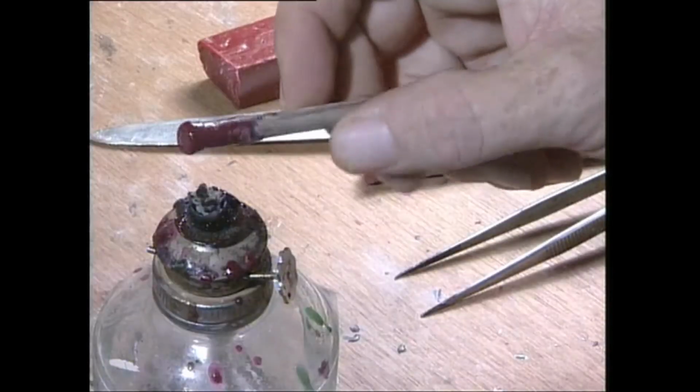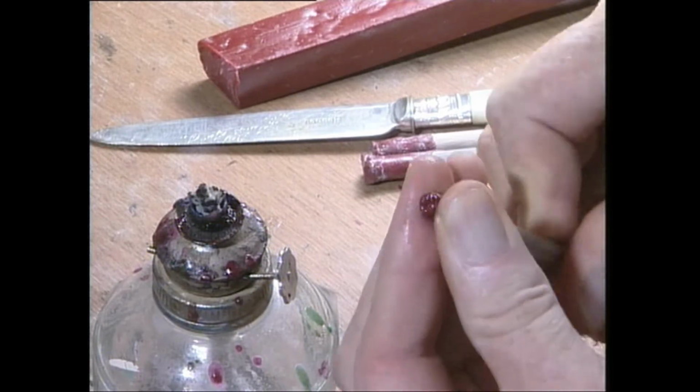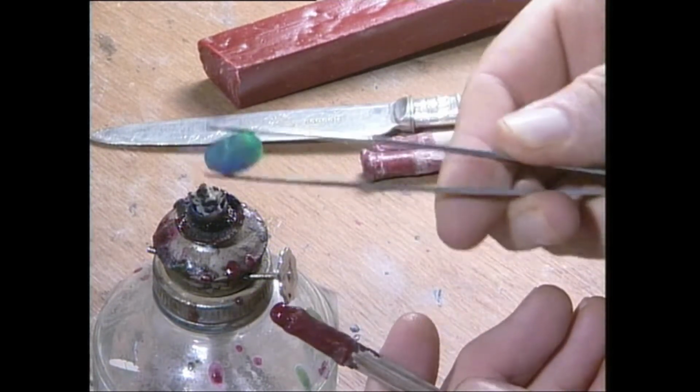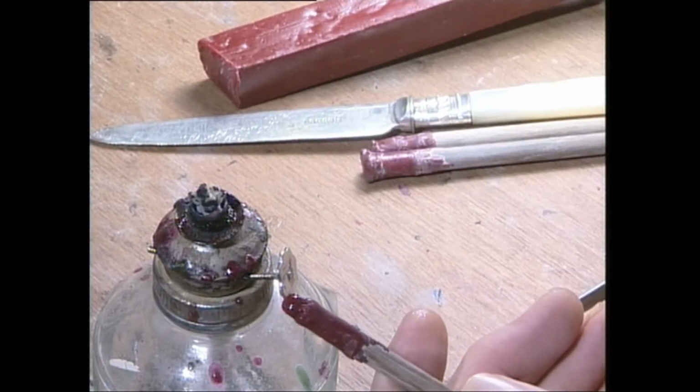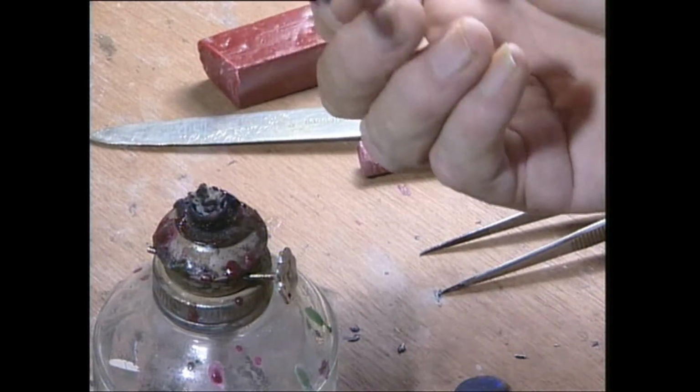And we'll take a stick here that's already been waxed, heating that, rolling the wax up as we just did previously. We take our stone, warm the back of it till the moisture evaporates from the face, and you will see that while you're doing it. Heat the wax fairly well. Place it as centrally as possible on the back of the stone.